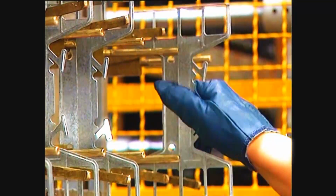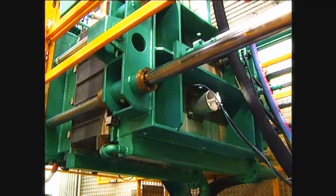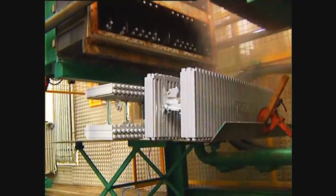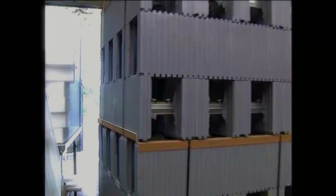Made in Germany in our own factory, our custom machines produce Argisol, a professional, unique wall formwork system made of neopor, an expandable polystyrene with galvanized metal stays embedded in foam. The silver-gray neopor foam contains graphite, which reflects and absorbs radiant heat and significantly improves insulation capacity.